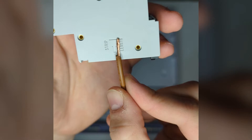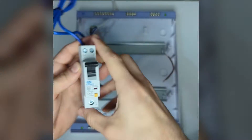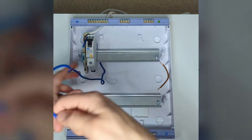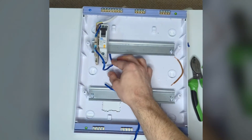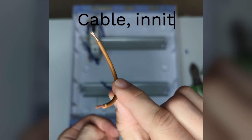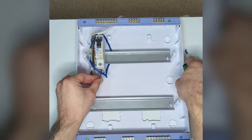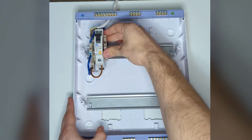A little hint on the side — there's a strip length indicator for the cable on the RCBO that you're going to need. You have live in, neutral in, live out and neutral out once you've protected the circuit. We're going to need a little bit of cable management because the push-in terminal block has feed in on top and out on the bottom. Strip to length, open a port, neutral goes in first. Need a short piece of cable to go between the RCBO and the live in on the terminal block. Clip it down in place and we're all ready. Another end bracket to keep it nice and tight.